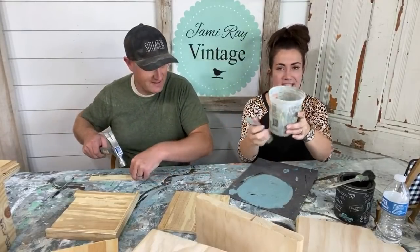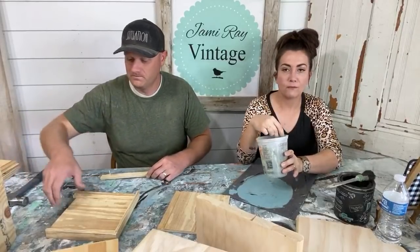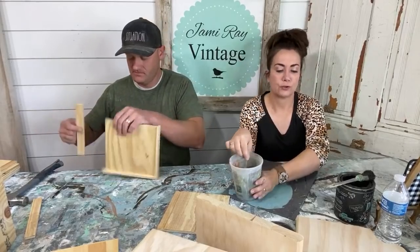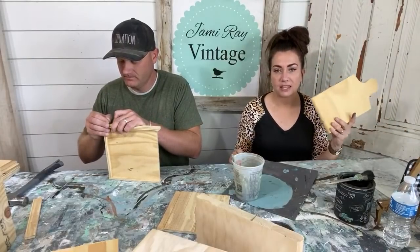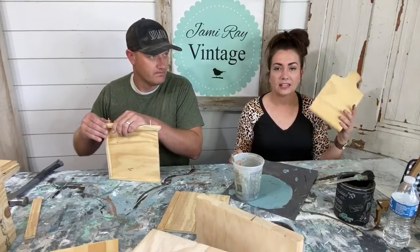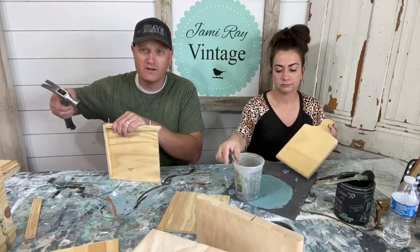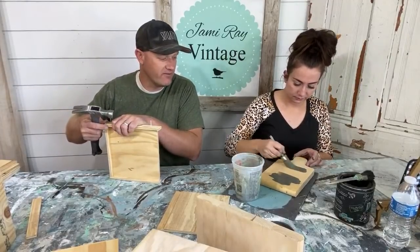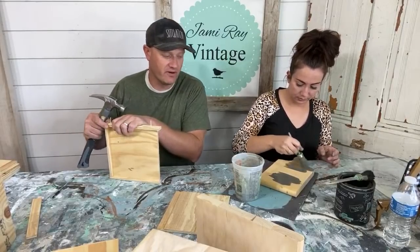So I mixed up milk paint in zinc and it's going to make a really great stain. This stain is food safe because milk paint is food safe, and we'll seal it with hemp oil, which is also food safe — a great option if you're making cutting boards to actually use. After you make this cutting board, you'll want to let it sit for about a week to a month. You can't put it in the dishwasher or fully submerge it, but you can wipe it off — just like any wooden cutting board.